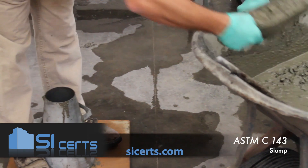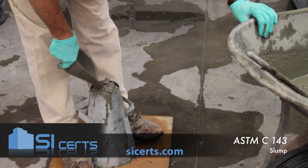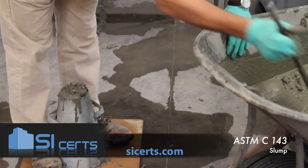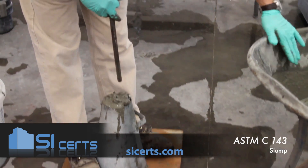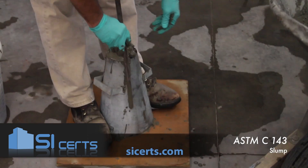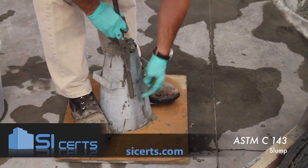The last lift should completely fill your mold. You don't want an extreme excess of concrete — you want it heaped up over the top a little bit, but you don't need an extreme amount of excess. As you're rodding, if at any time the depth of the concrete falls below the lift, you'll want to add a little more. You're going to penetrate that second lift approximately one inch.